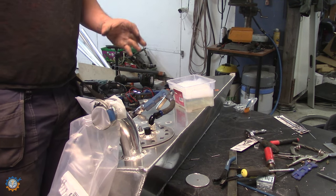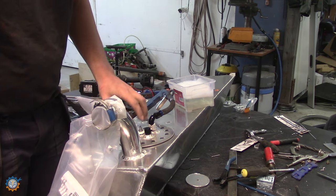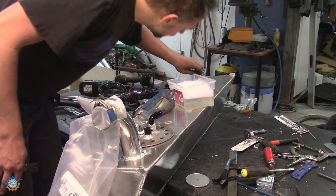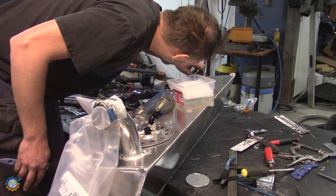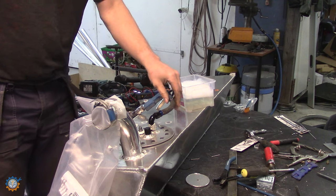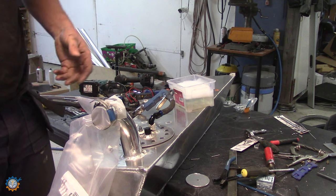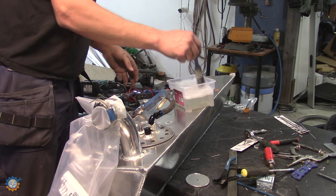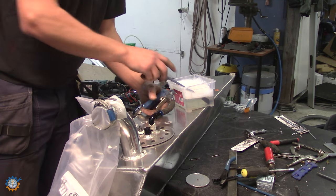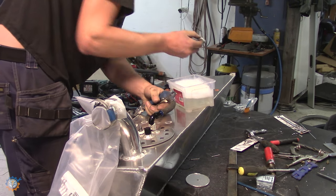So, what could potentially go wrong? I'm guessing that the seals for those can leak, for the electric, and for the meter can leak. I have not even checked the meter if this is tight enough. So we'll see. So let's fill it up, and I know that this one is leaking out a little bit here, so I need to fill it repeatedly, and we will have some soapy water here and add it to it and see if it bubbles anywhere. So let's start. And I can hear one leak, and it's over here, and I'm thinking this is the one.